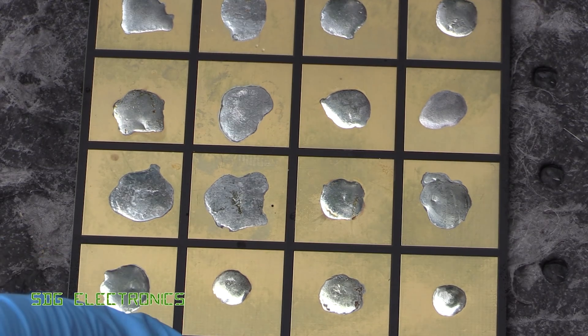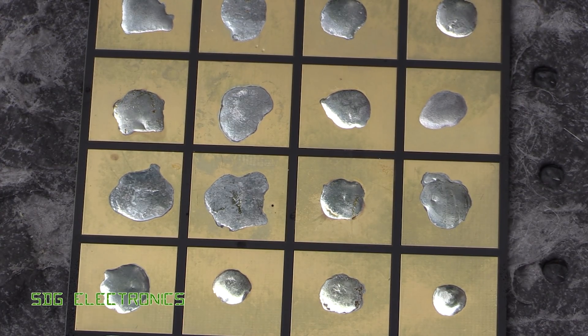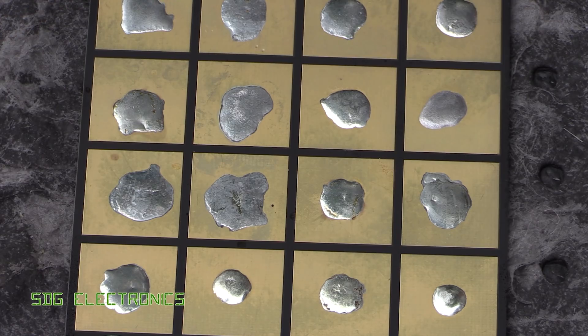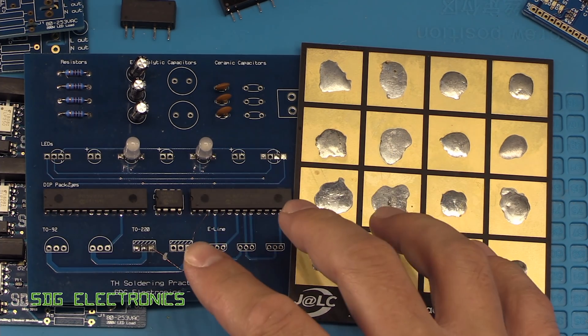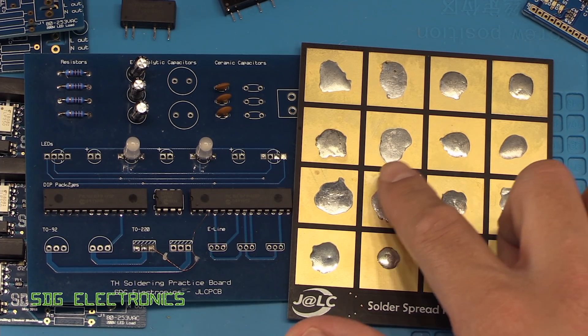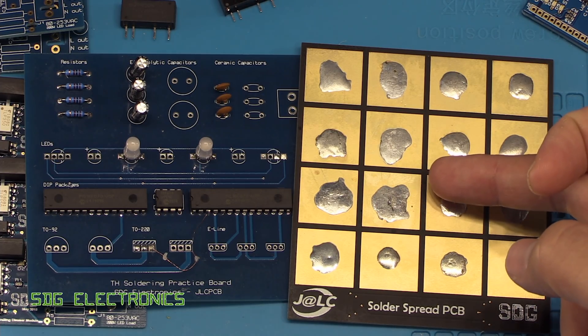No problems with the silkscreen, no problem with the solder mask, nothing has gone sticky like it would do with acetone. So actually these two products look quite feasible for using for PCB cleaning. If you use the slightly more aggressive one, you probably wouldn't need to do very much scrubbing at all to get a completely clean PCB. No damage has been sustained to the PCBs or any of the components on the boards, and the ease at which it lifted the rosin when I was using the VTEC brake cleaner was really quite impressive.